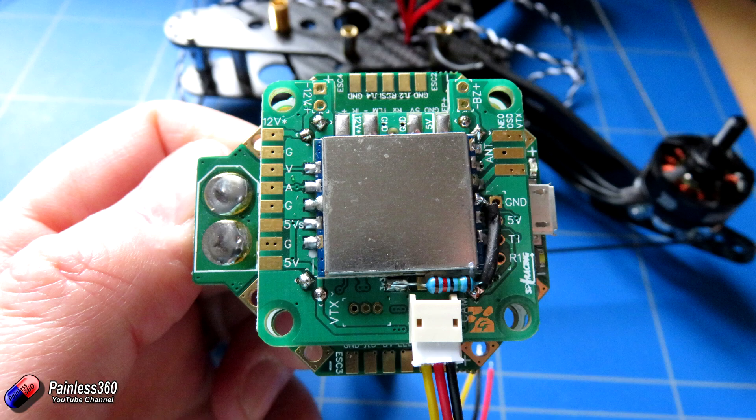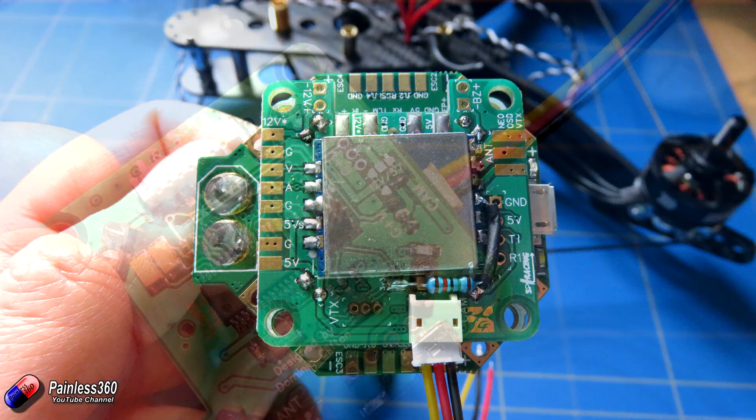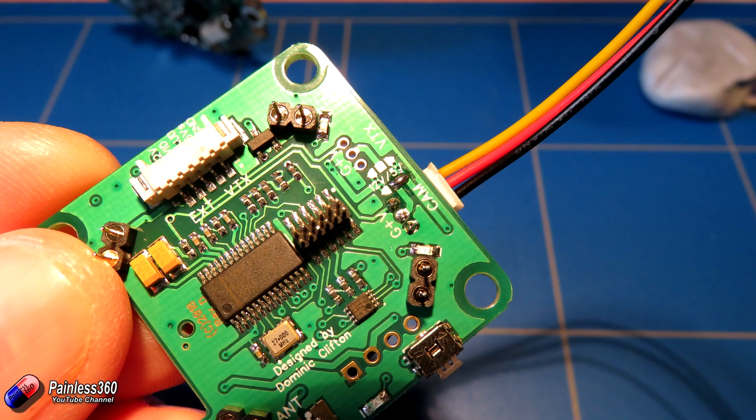So first of all that's where I start with the soldering. You are going to have to have a decent soldering iron and you are going to have to have a reasonably fine tip and steady hands but it's absolutely doable. Next thing you need to do — and this is the only other bit of soldering that you need to do in terms of voltage selection — with this little selector you can choose the voltage for the camera, whether it's 12 or 5 volts.